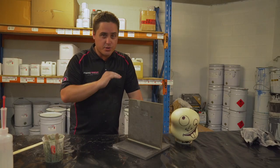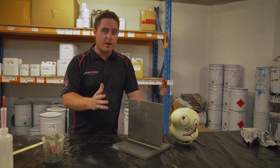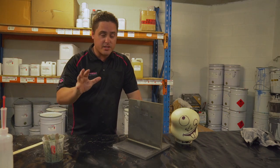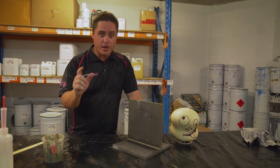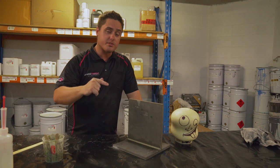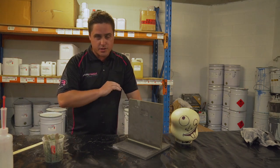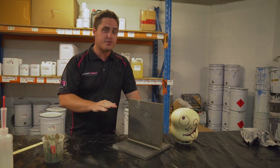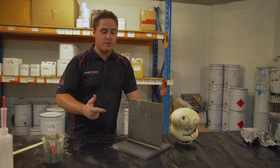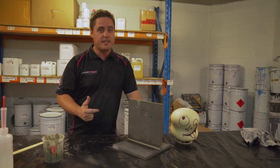Well, there you have it — that is the super quick way to do peanut butter bog. Your choice of resin, whether it's polyester, vinyl ester, waxed or unwaxed — different horses for different courses, and we're going to go over that in a whole separate video. The things you need to remember: how much resin did you put in? Because that's the crucial one — not the overall weight, but how much resin went in. Once you add a filler to your resin, the working time speeds up. So remember, if you're getting 45 to 60 minutes out of your resin, as soon as you put the talcum powder in it's going to speed up. This product is super good for your coves, super good for putting in stringers, and doesn't have the strength capabilities of fumed silica — but for the price, how easy and quick it is to make, you can't go past it for these sort of applications. Stay tuned for more, and if you've got any questions, definitely hit us up. Thanks very much.